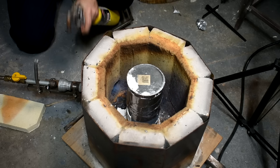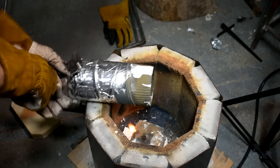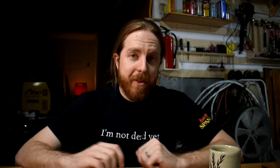So the burnout process — just like any other lost PLA — I'm using my foundry furnace for this. I threw it in there, got it to a dull red, held it there for about an hour, hour and a half or so. That seemed to work just fine. I actually have a nice electric controllable oven I could use for burnout and I fixed it recently in a video, but two days later I was trying to improve it and I broke it in a different way. If you use ceramic shell — where you dip in a special ceramic instead of plaster — the ceramic firing process will completely burn this stuff out, so just doing that you'll be ready to go. When it's been in there for a couple hours, pull it out while it's still hot. I tried to get a shot down the hole of the Mandalorian helmet one, but it's really hard to get a picture down a hole and get light down there at the same time. There's no ash in there — it's pretty cool. That's why this filament is good for this.